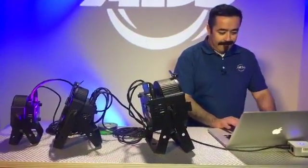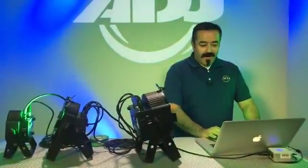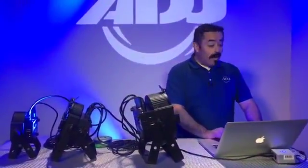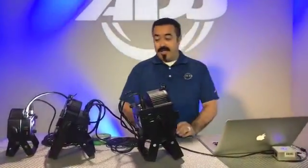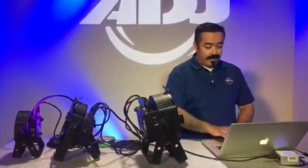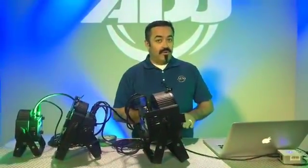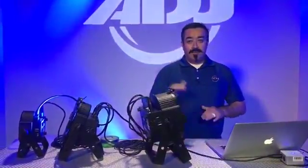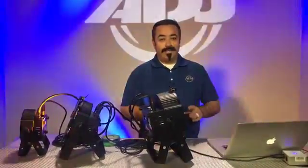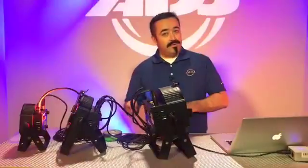Samir wants to know how many DMX channels. Samir, DMX channels. So at the very most, we're talking about 12 DMX channels, and that's the highest DMX channel mode available. At the very least, you get 6. So full control over each color from 0 to 100%: red, green, blue, white, amber, and UV. At the very least, 6 channels. At the very most, 12.